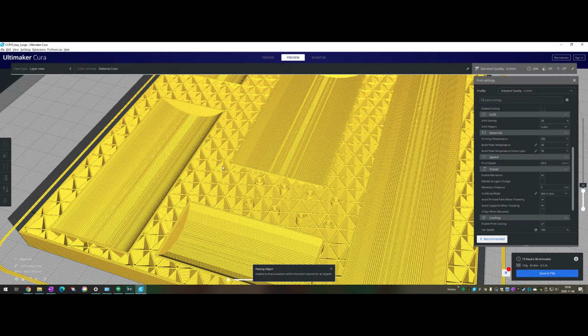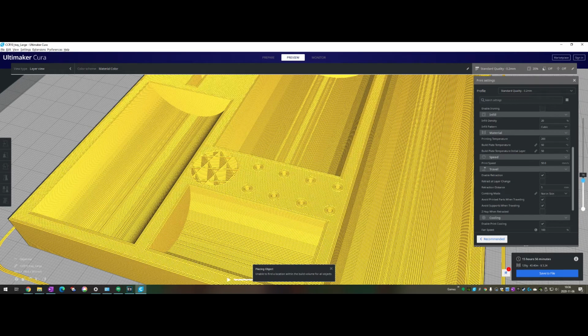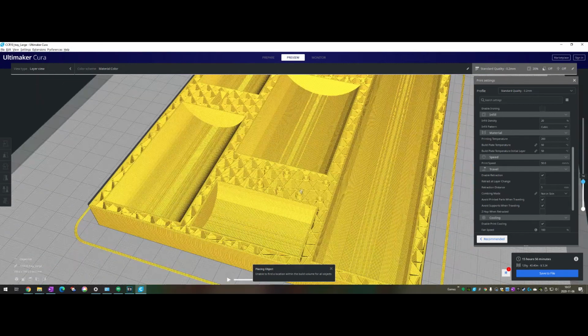You do need to consider how much infill density you need, because the infill density acts as your support when you finally start doing the layers that will cover up the inside hollowness, okay? And you only have so much distance before you're going to have troubles with extruding and stuff, and it will droop. And that's why you want to pick a number that is good for your printer and make sure that it doesn't exceed the distance that will cause problems with the print and maybe fail your print.